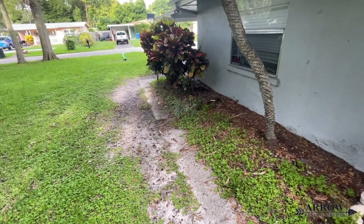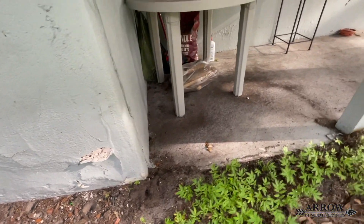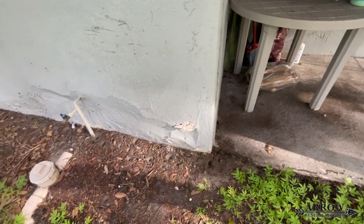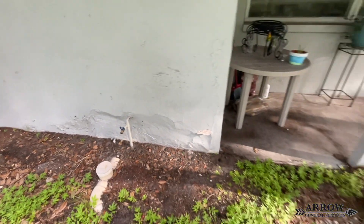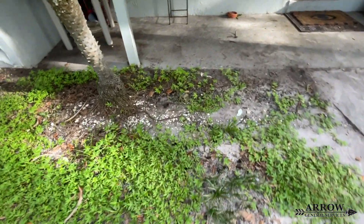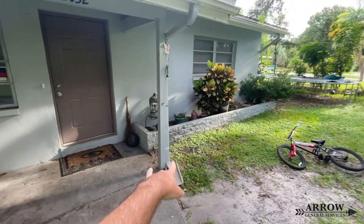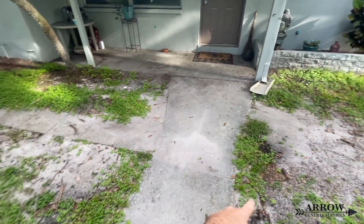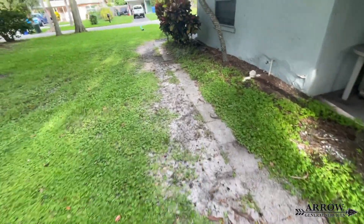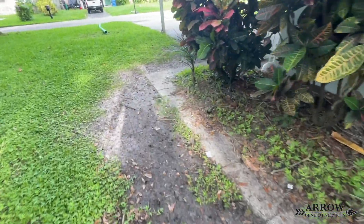Welcome to the Aero General Service channel. I'm your host, Corey Bartolotti. In today's video, we have a home experiencing a large amount of flooding in the front that's causing water damage all along the front exterior wall, causing the ground to erode and dirt to pile onto the porch. We're going to put in a couple of catch basins, grab these gutter downspouts, pipe them all into a system, and send the main line all the way to the road to discharge there and evacuate the water.